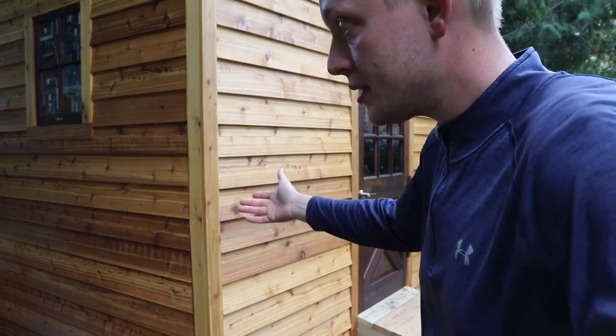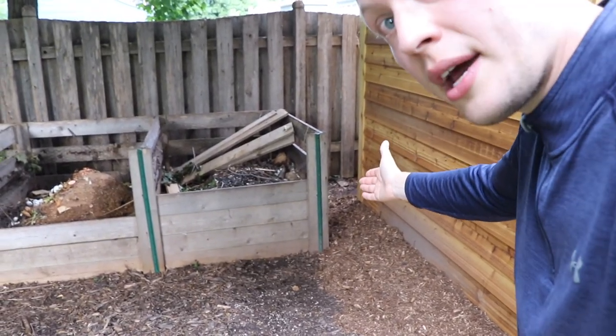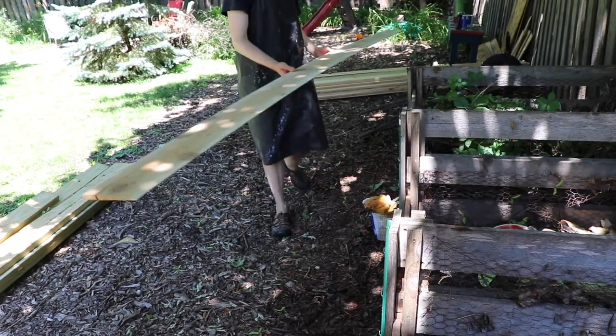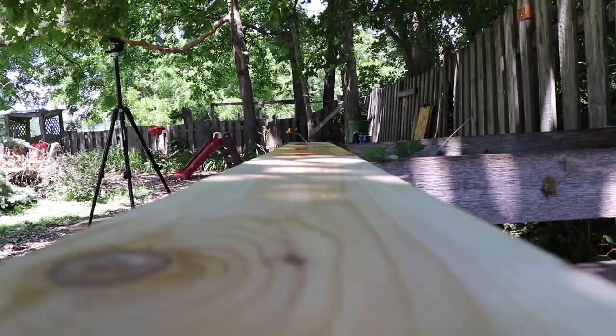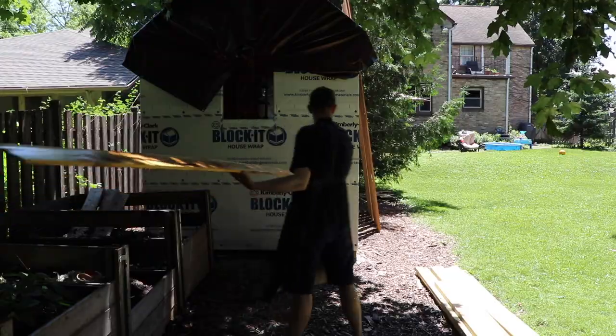First off, all of your boards need to be treated — let me say that again — all of your boards need to be treated. If you don't treat your cedar and you want it to look beautiful, it will brown out and gray out, like this compost pile I made seven years ago, or that fence we inherited from the previous owner. I found a finish meant for exterior wood siding and decking and went with a clear coat because I love the beautiful amber color. It comes in a whole bunch of varieties if you want to add a color tone, and it needs to be applied on all surfaces — the flat front, the sides, and the back.